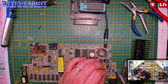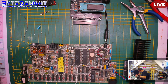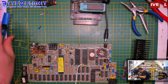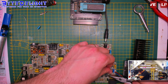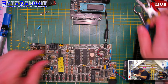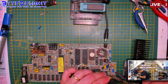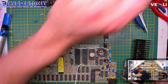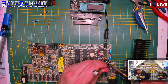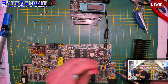So, a brand new capacitor here, 22 microfarads. And I even dare to put back the minus 12 volts circuit here by putting the resistor back in. So my debugging was okay. I was thinking in the right direction, but I just didn't check that capacitor. I should have done it earlier on. You can see I swapped the diodes here. They're not in the board quite nice. Not as nice as I want to, so let's see if we can do that a bit nicer. Yep, that's what I wanted.